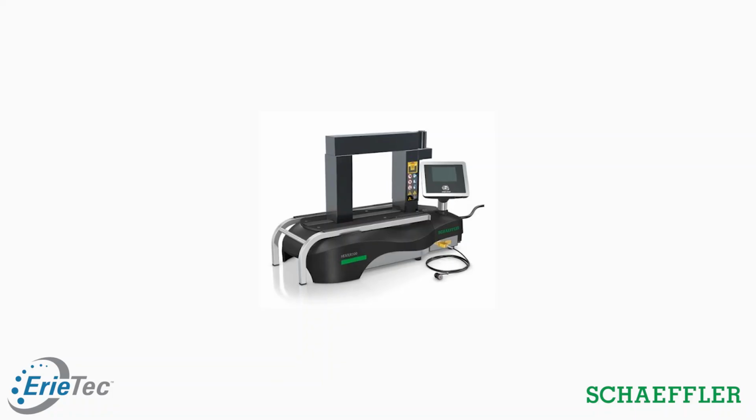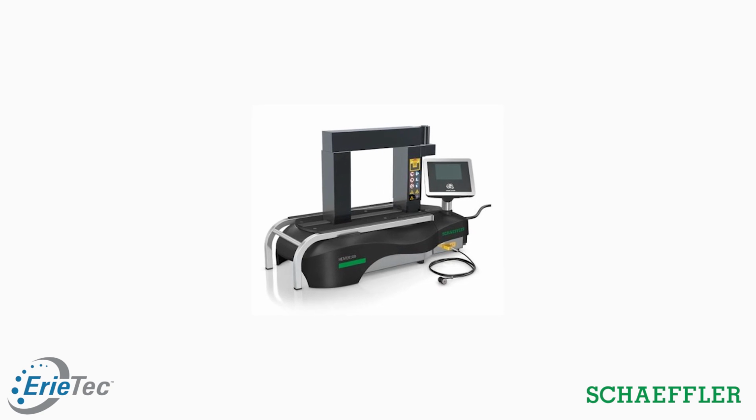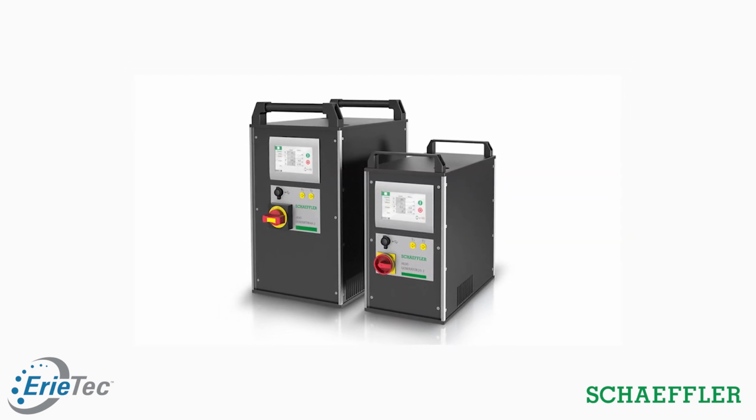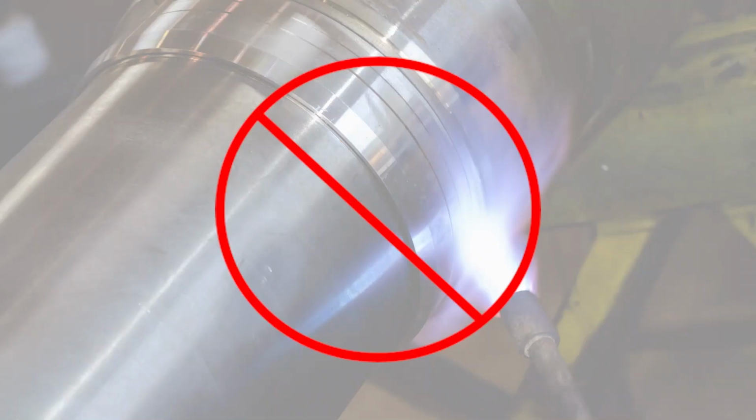Next, you're going to start the bearing installation. Typically, the OEM provides you with an instruction sheet of how this bearing should be installed. If they don't, you're going to need to look at which member is tight fitted and which member is loose. If the shaft is a tight fit in the bearing, you're going to need to heat the bearing with an induction heater. If the housing is a tight fit, you're going to use a medium frequency induction heater to heat it up and slide the bearing in. Try to avoid using torches and open flames. The localized heating these can create can affect bearing life by changing the metal structure of the bearing or of the housing.